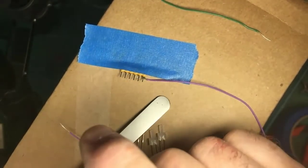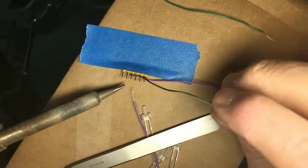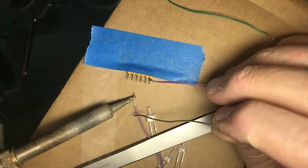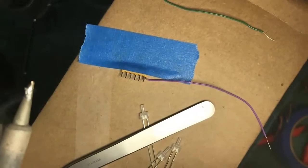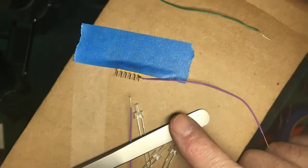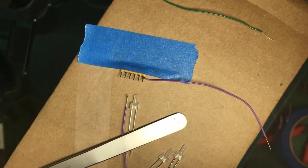That's right, I left this one untinned so I could show you, gentlemen, tinning this wire. Clean the tip of the iron. The wire in the field of view, yes. Wet the tip. And then I just run down the wire. And it is tinned. Again, using rosin core solder. On fresh clean wire like this, no need to use rosin paste flux or anything like that. If you had old wire and it was green, you should throw it away.